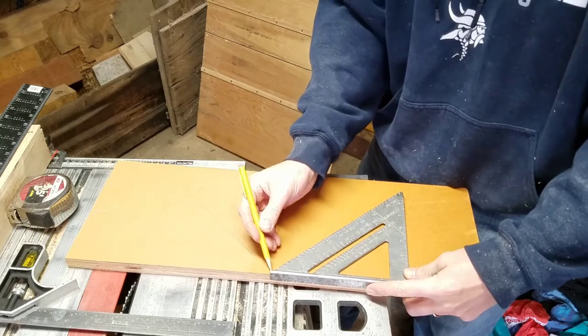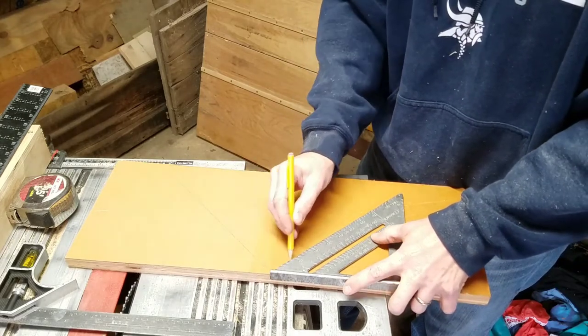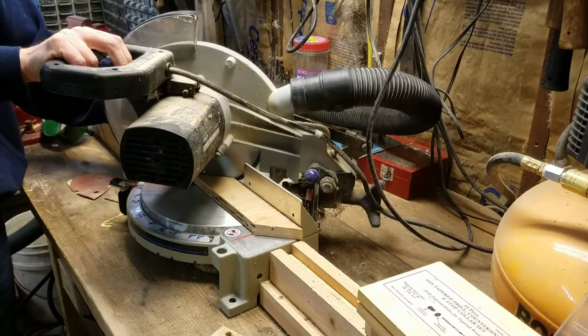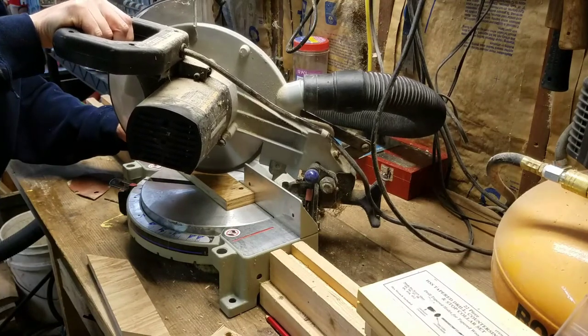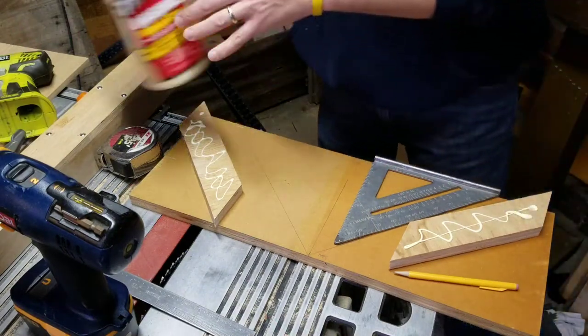Now I move on to the vertical panel of the jig. Here I found my center line and then I created two 45-degree angles with my speed square. Next I cut the vertical supports for the spline jig, cutting 45s on the ends — and that's really pure aesthetics. You could have 90-degree cuts on these and it would be no issue whatsoever.